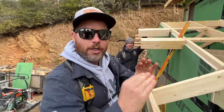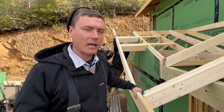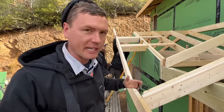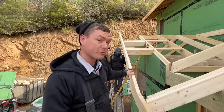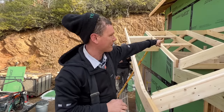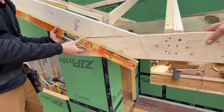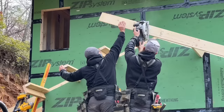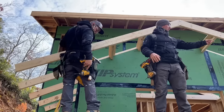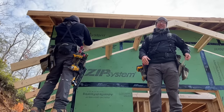At that point it's going to turn up and go this way. We could have just run this all the way through as a faux little overhang - you see that done a lot as a detail - but since it's a low pitch gable I think it's going to make that gable end look too small and squatty. So we're just going to clip this off and turn it up the hill. We're not using any fancy math - it's extremely low tech. We're just sighting, using a string and a level to determine if the top of this board is in plane with the top of those boards.